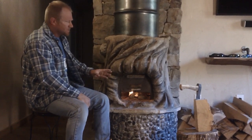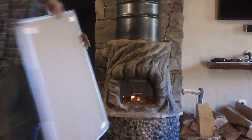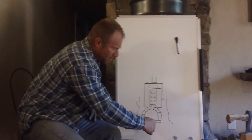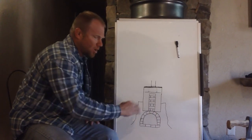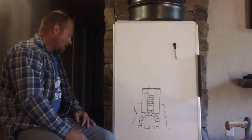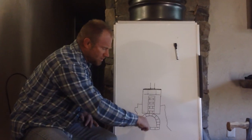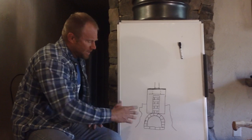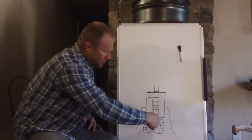Inside, I want to show you how I built this — it's a little bit different. It's got a layer of fire brick that the burn chamber is sitting on, and the fire brick was put in an arch and built in there. How I did that was I built a form for that arch, laid the fire brick, put shims on the back side and spread them out evenly, then took clay fire brick mortar and filled in those cracks.